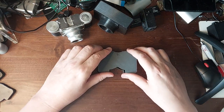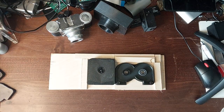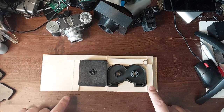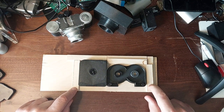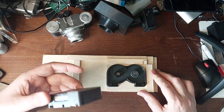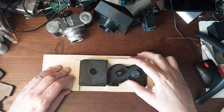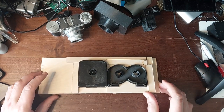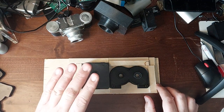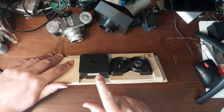I considered it ready to try filling with film and putting it in a camera, so I built this jig. It was simply from pieces of off-cuts of laser ply from my hackerspace, cut with a bandsaw and stuck together with double-sided tape — surprisingly robust for what it is. I sized it to fit a Super 8 cartridge here and my Single 8 cartridge here. Because of the orientation of the film with the sprocket holes at the bottom, the Super 8 cartridge has to be upside down and the Single 8 cartridge is raised up a little to be at the same level as the film.